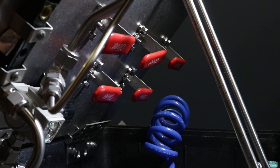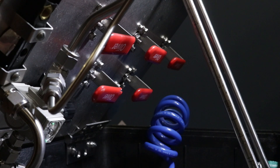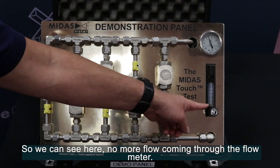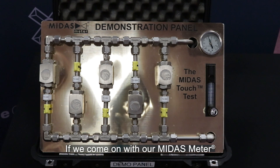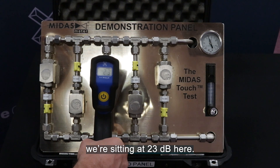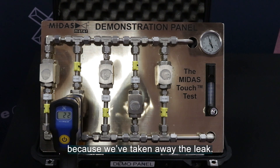You may also be able to hear the air escaping from the outlet of the flow meter. If I fully close that valve, you'll hear the noise go away as has the leak. We can demonstrate that by showing you the flow meter reading zero and the decibels on the valve. We can see here no more flow coming through the flow meter — we still have pressure, of course. The valve is now in a fully closed position. Coming on with our Midas Meter, we can see we're back down at a background reading — in this case, just a couple of decibels above the zero reading of 21, sitting at 23 decibels.